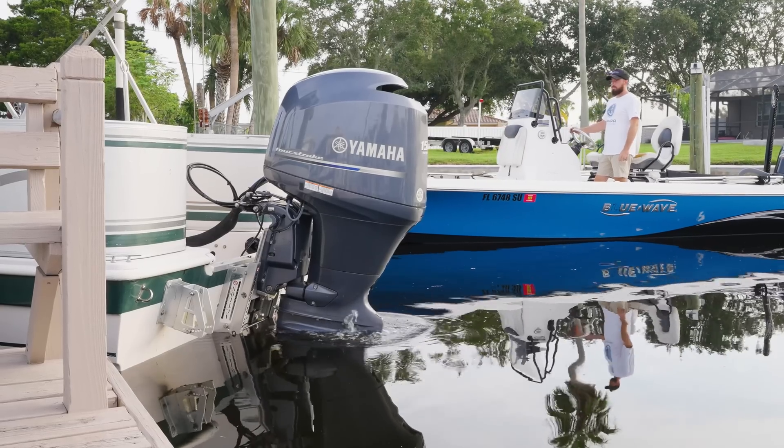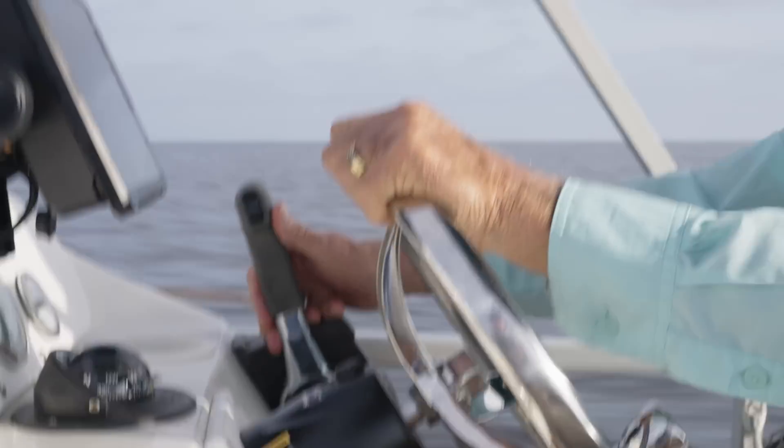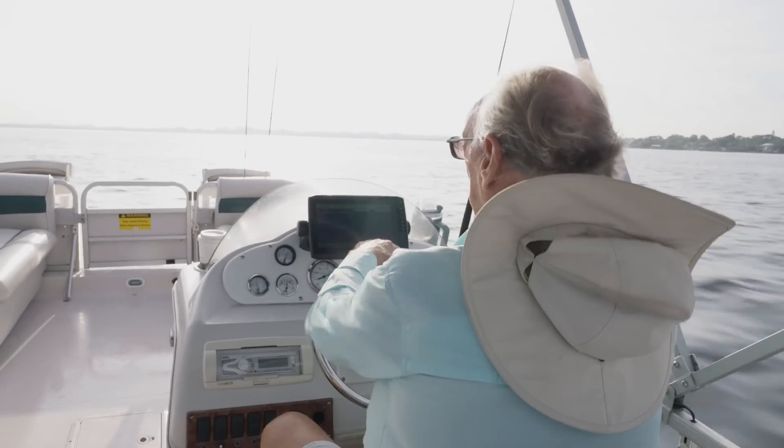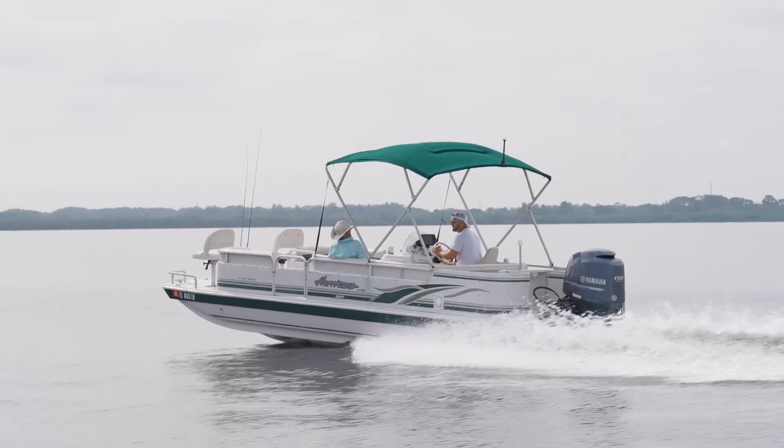For example, we did a boat on this trip that was already kind of hitting the rev limiter before the tune. The extra 50 horsepower we gave that engine made it even worse — it just wasn't propped correctly in the first place, so we didn't get great gains out of it. When he eventually props correctly, it's going to run great. What we recommend is: get your tune, know where your numbers are currently, then evaluate them after. We send a lot of customers to Ken at Prop Gods — he's super familiar with these tunes and can get you a good prop pairing.